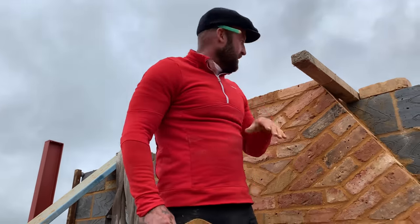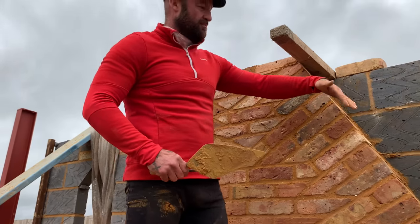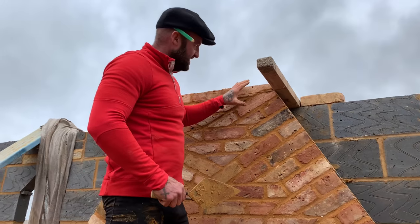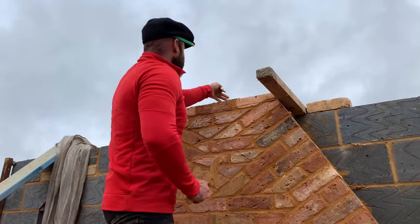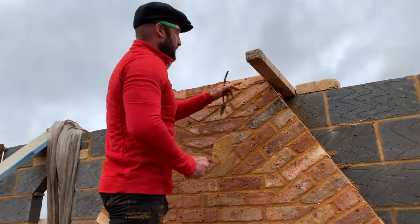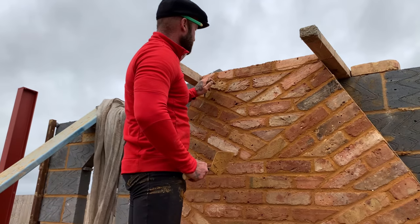a little look. Now, in this scenario here, what I've done was we've done three. Because four bricks would have took us too wide, it wouldn't have been enough for the detail to fall in. Three bricks for me on this distance over, what, 25 course was fantastic, right? So, get your centre line, get your three bricks, measure out, and then put your profiles each end of your three bricks. Okay, as you can see, one, two, three, we're finished. Put a false joint in there just to keep it bonded.